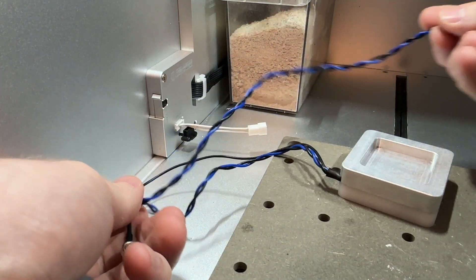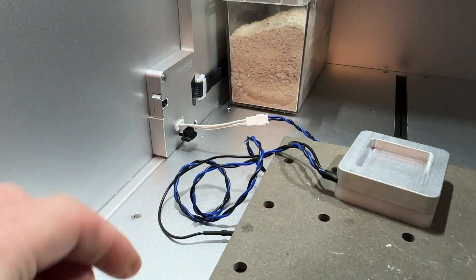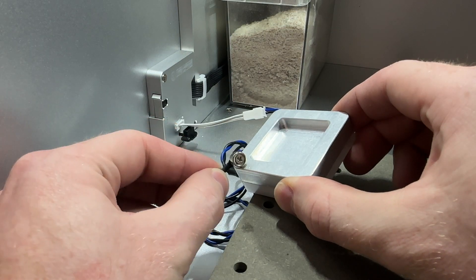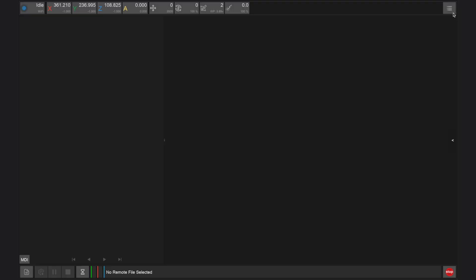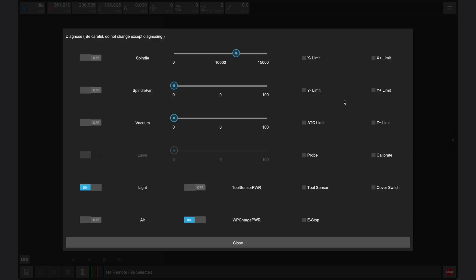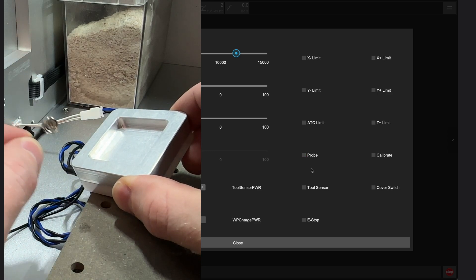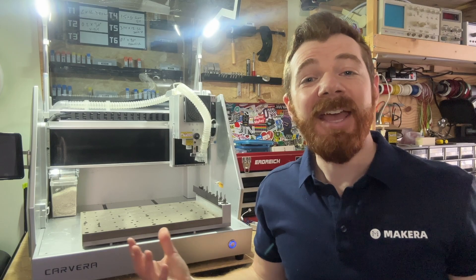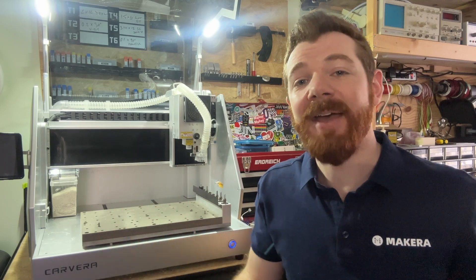To test the wiring adapter, connect the manual XYZ probe to the probe port on the new wiring adapter using the plug adapter included in the 4th axis kit. Touch the magnetic connector to the probe block and check that the connection is functioning by seeing the probe indicator light up in the diagnostic window of the Carvera controller app. If this is not working, refer to the wiring steps in the manual, check your connections, and reach out to the support team. Note that all Carveras with a serial number starting with C1R will already have these steps completed.